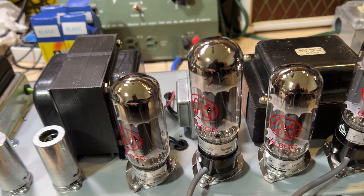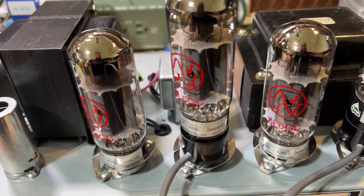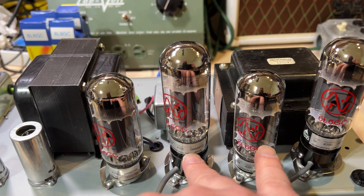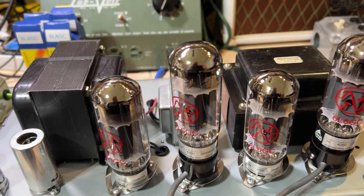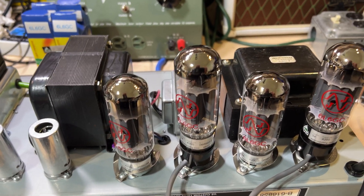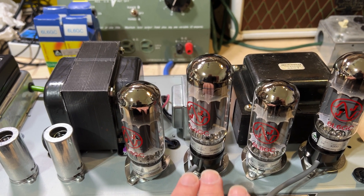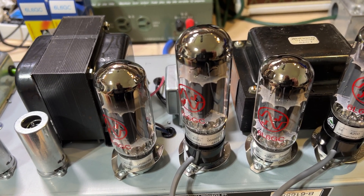Another thing to consider: if you're only dealing with a 50-watt tube amp you're just going to have two tubes, or if you have a 30-watt amp using 6V6s, with two tubes you just need to test one or the other. Now if it's a four-power-tube amp like this Fender Twin, your tubes are arranged in pairs — two on the inside and two on the outside, in most guitar amplifiers. So we're going to test one inner tube and one outer tube when using the ComputBias, since that can test two tubes at once. For the single-tube tester, we'd test one of the internal pairs, let things cool down, then move it to the other side.